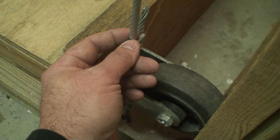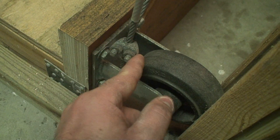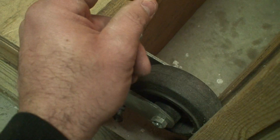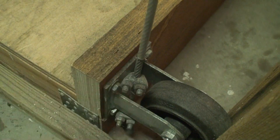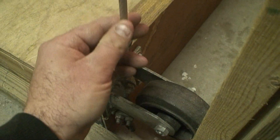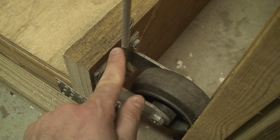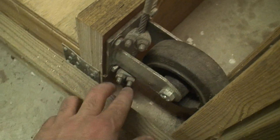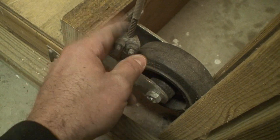Now when you're using coated cables, make sure you strip the coating off where you bind them together. You never want to bind the coating together, because that cable will pull right out of there. That's a very important thing. If you do use coated wire rope, you can see here where I cut the sheathing off, pulled the sheathing out, and then wrapped it before I put my fastening points on and spliced it together.